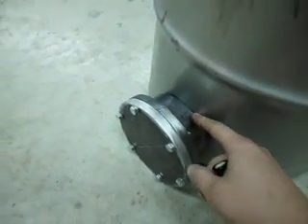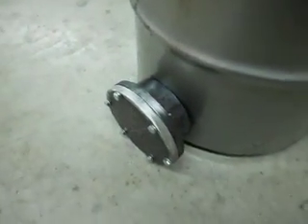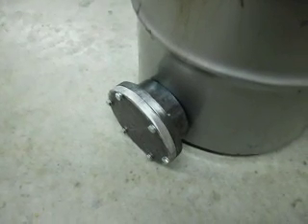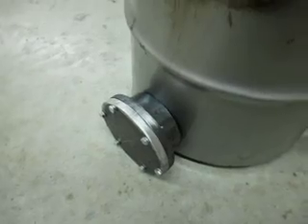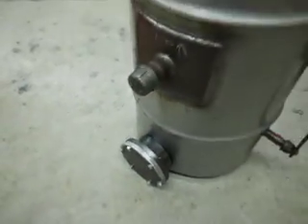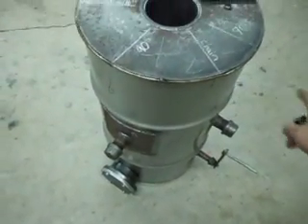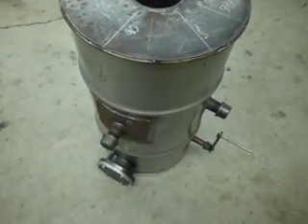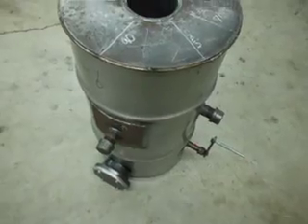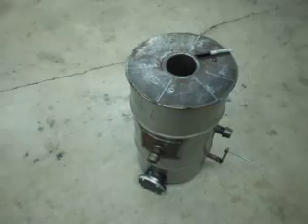The clean-out port — I just built this today, so obviously it's not installed yet. It's the same four-inch pipe quarter-inch wall, cut an inch and a half long, and I built these flanges out of half-inch plate, which is probably overkill, but it's what I had. My plan is to run gas out through a cyclone filter, then through a sawdust filter, then into a little homemade cooler, and hopefully that'll give me clean enough gas to run a stationary generator.